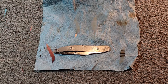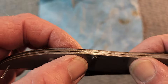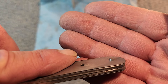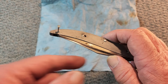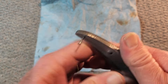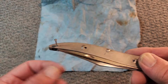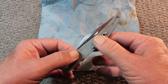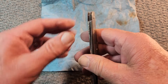I'm not set up to film the peening right now, but I wanted to show everybody something. I've got the center pin in and the springs are under tension. I've got this one and I'm getting ready to finish peening that end. I almost forgot — I got this pretty tight and forgot to line up down here because those springs were under tension. It's a good thing before I did the final tightening I got these lined up. I should be able to get the last pin in after that. Look — this isn't even tightened yet but looky there — I think we're going to have a pretty successful restore here.